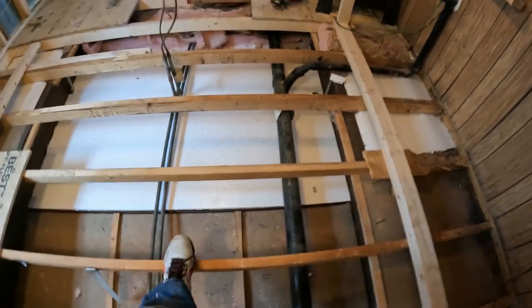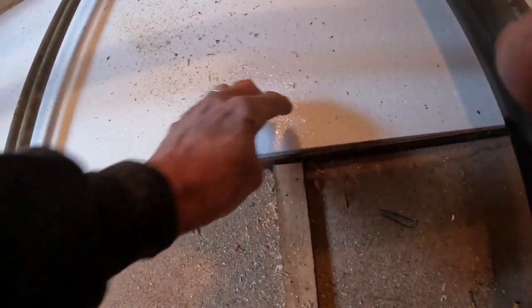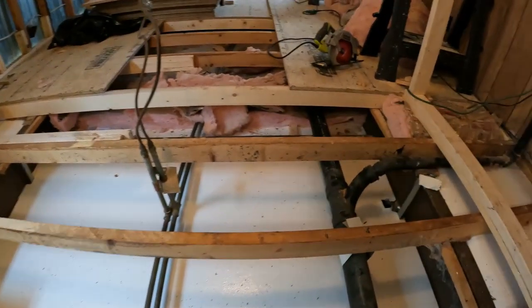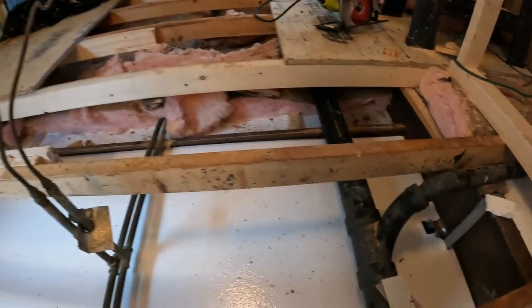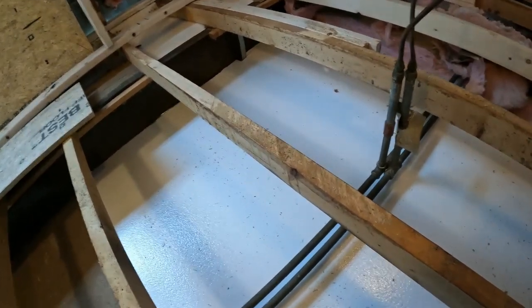That's what your underbelly should look like from the top side. Now, the other thing we'll come back down through here is, that's not coming up or down. It's not floatable. But what we want to do is put a piece from here over to here. Hold that down. Not to mention there's going to be insulation on it. If we put a piece of block from here over to here, and do the same over there, just like you're looking at down there, see that blocking? That's going to hold these things together. Nice and tight. Can't blow up. Can't go down. Insulation on top.